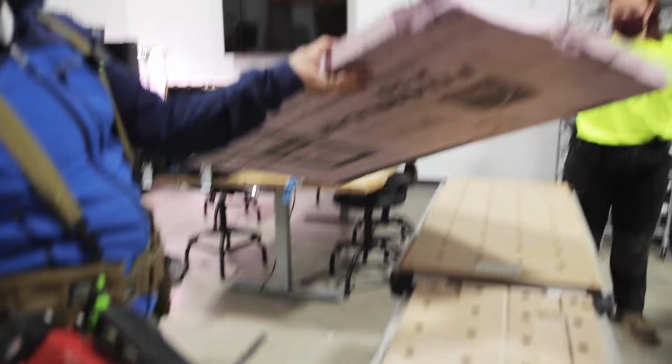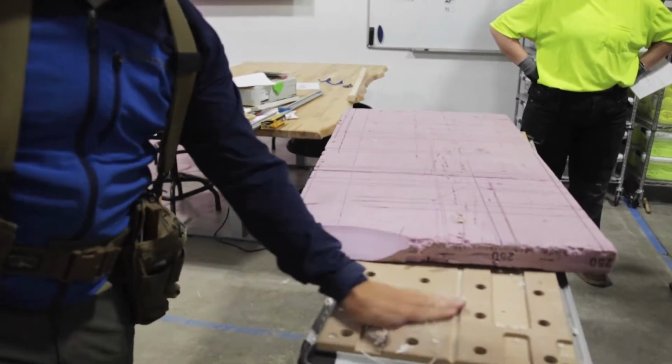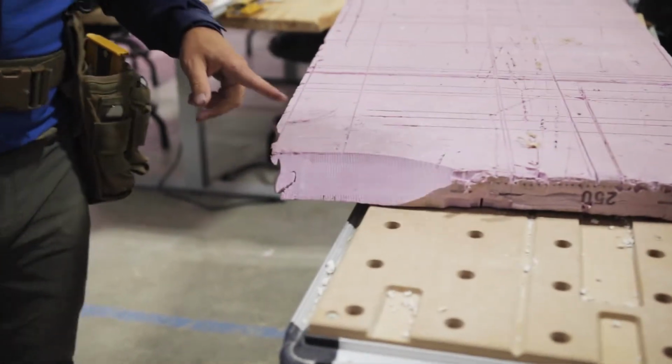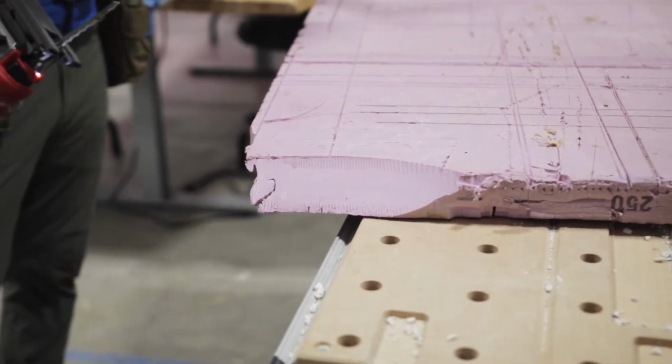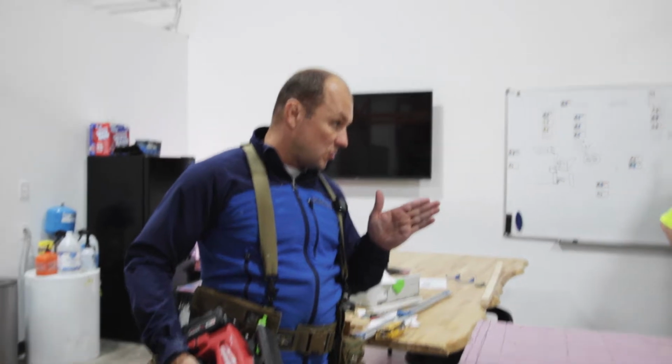So see how that cuts with perfect factory? If I sawed that, it would be rough, like a coffee cup, right? That bead foam. And so you don't want that. But with that being said, this will bend, just like any blade. So the whole issue is cut slow, cut straight.